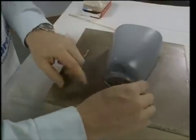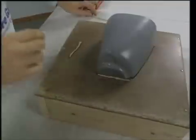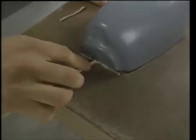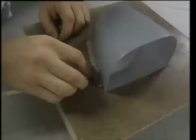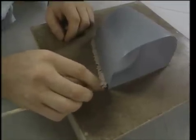Next, the gaps around the plug need to be filled in. Dennis uses the number 104 clean clay, a non-drying, oil-based clay which allows for future application of wax and PVA. Compatibility of all molding clays and mold release agents is very important.